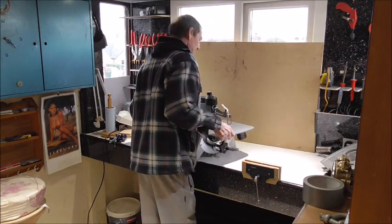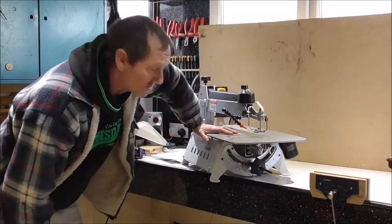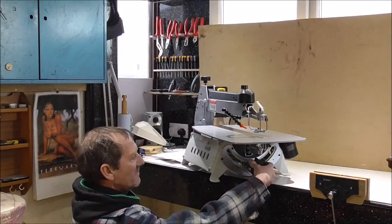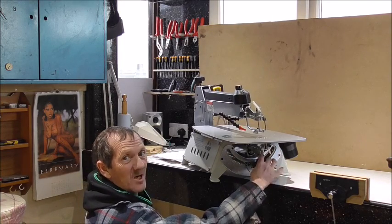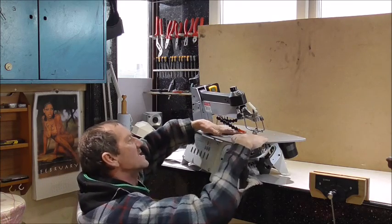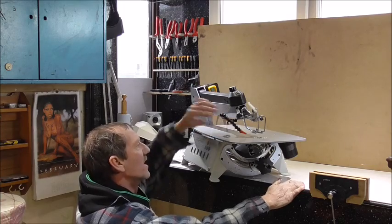Now, the main feature of this type of machine is this piece here. Underneath, the mechanism for tilting — not the table, but the machine itself. Loosen off, and as you turn it with the ratchet teeth, it will tilt the machine completely, leaving you still working on a flat surface, which is obviously the most comfortable. And as that tilts, you can then level it back up so it still holds the wood down good and firm, and adjust the blower as you want.